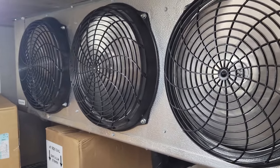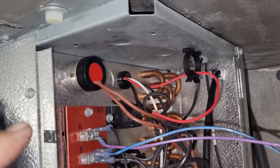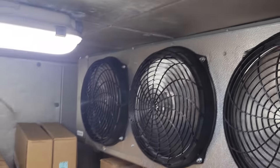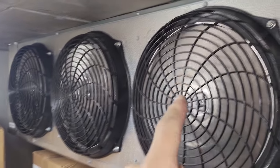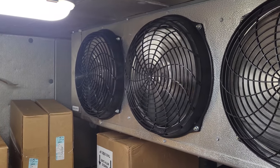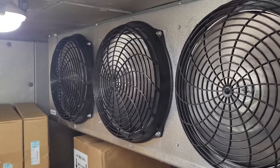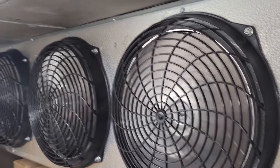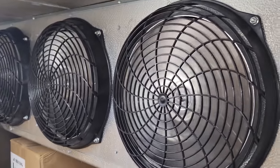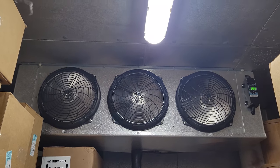Here's the problem — we have two bad fan motors. They're shorted internally, so this one's running on full speed. The way I proved this was I disconnected the two-speed relay. If you pull the red wire, you should disconnect the two-speed to the motors, but they're all wired together. So I went in and unplugged every red wire to each motor, and this is the only one running at full speed — these two are running at slow speed. So we have two bad fan motors, just shorted or something inside. They still spin, just on slow speed. This sucks, but it'll get them through the weekend — the closest supply house is quite a bit away. I'll come back with two new fan motors. I come back in to check on it and now the left two motors are spinning at full speed — it's just intermittent.